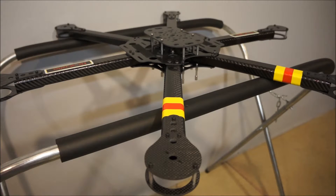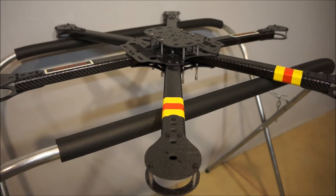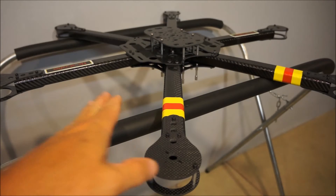Understand that as you are doing this process, if you are using the same digital angle gauge and are not sure which side to shim, you can stick the shim on the bottom magnet and reposition it to see whether you need to shim the right-side two holes or the left two sides of the motor. The shim goes between the bolt — which comes up through the motor mount right on top of the motor mount — and then the motor goes on, and that will cant the motor at just the slightest angle to achieve motor alignment.